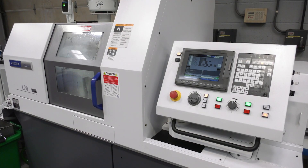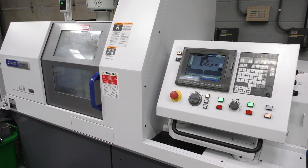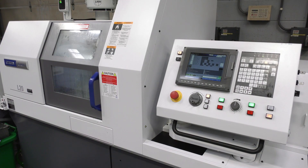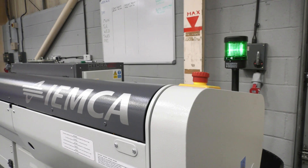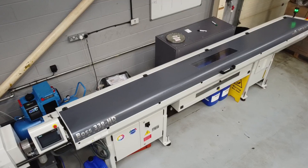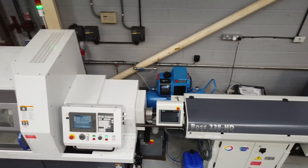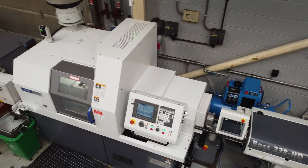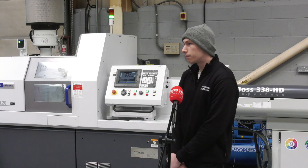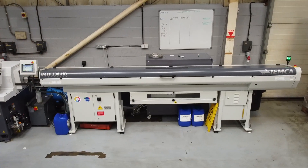So far you're enjoying using the machine? Oh yes, absolutely lovely. The three-meter bar feed - this is the L20, but it will go up to a larger diameter? Yes, we've got the expansion kit that Citizen provides, which takes it to the L22 - maximum size 25mm diameter. And is it easy to change the bar on these machines? At most, it's about two hours' work to change from one size to another.